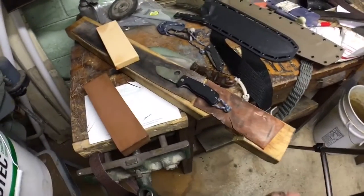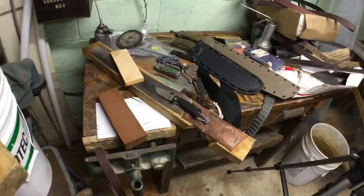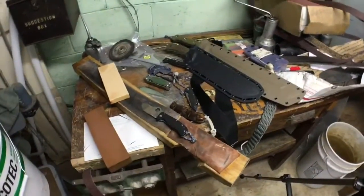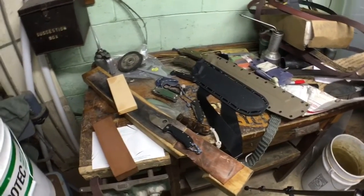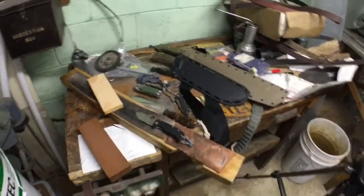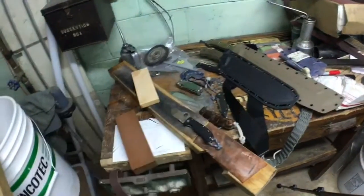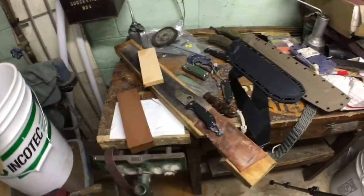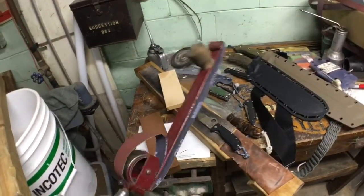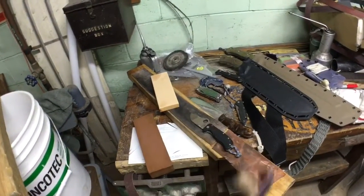Super simple. I think you can get a lot more accuracy and knowledge from learning to freehand sharpen rather than using a jig. I'm sure if you get into steels that are 65 Rockwell and up, you might have some problem with these stones cutting the metal, but I've had absolutely no problem with up to 63 Rockwell and everything below that. If I do have to adjust the geometry quite a bit, I typically use this with some 220 grit sandpaper and then proceed from there.